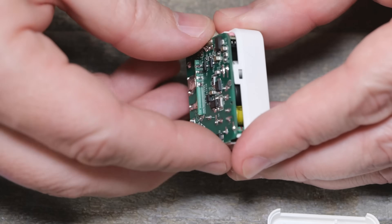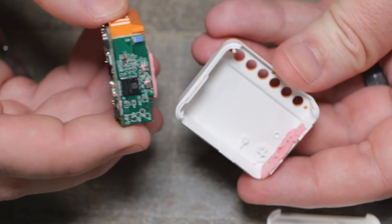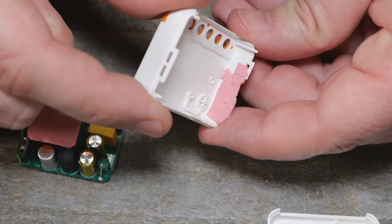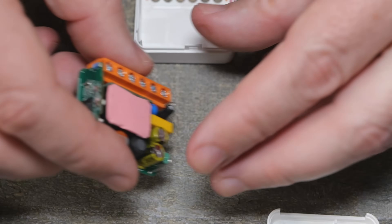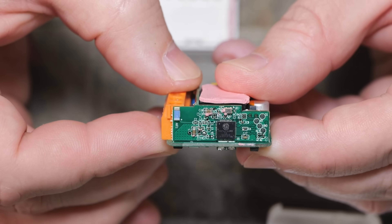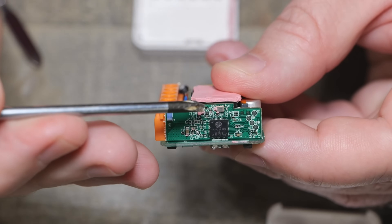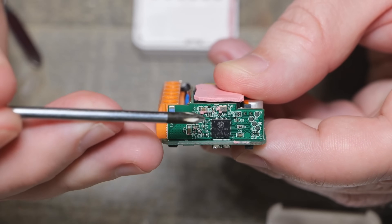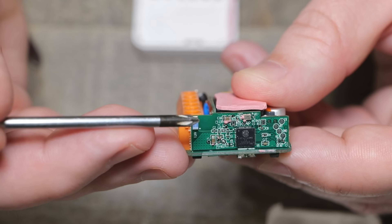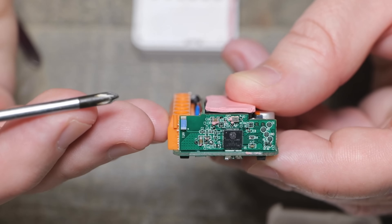I noticed there's this pink stuff on the side — like a thermal paste, the kind you'd see to help dissipate heat off the processor. Taking a closer look, you can see that's ESP — it has deteriorated a little bit, probably from that pink goo on there. It's an ESP32; not sure if it's dual core or single core. We'll take a look and give it a shot — is it going to be bootloader locked? We've seen stuff like that recently, like the little Roku plugs.